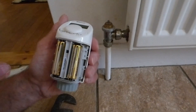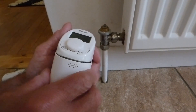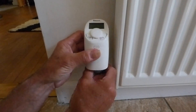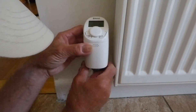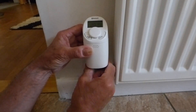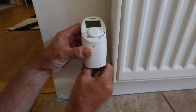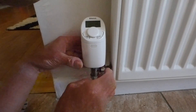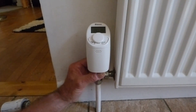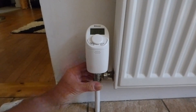There's a little battery strip in there — pull it out to activate the batteries. I've already pulled mine out, which is why it's reading on screen. There are two batteries and you pull the little strip out and it will be live. Battery life is around two years, which is not bad. Once you've done that, face the valve towards you, start the thread nice and square — you don't want any cross-threading. You'll feel it notch down and tighten up. Tighten it as far as the thread will go; there's no need for grips — it's a plastic nut and you could split it.